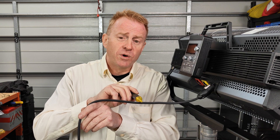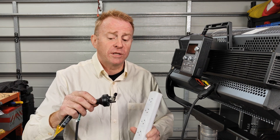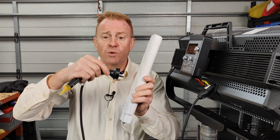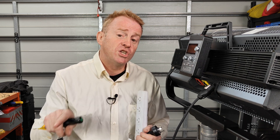Let's do this scenario — we've got voltage. Well if I've got voltage I can't possibly have tripped a circuit breaker, so I know I don't need to check the fuse box. Even though I've got voltage, that doesn't mean the fault is necessarily in the light — it could still be a power connection problem. You can have voltage but not have a power circuit. For the light to turn on, power has to come out of your connection, go through the light, and back. Somebody might have knocked the cable so your active is making contact but your neutral is not — in which case you have voltage but no power circuit. So regardless of whether I get voltage or not, I'm still going to go through and check all of my connectors.